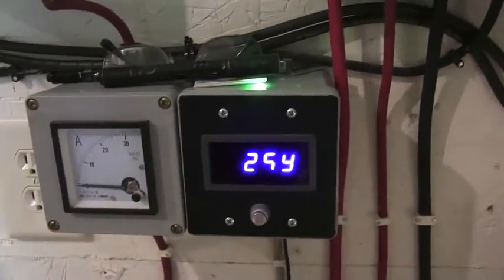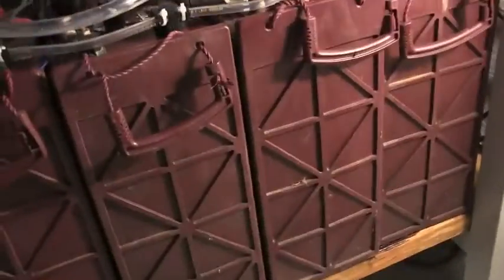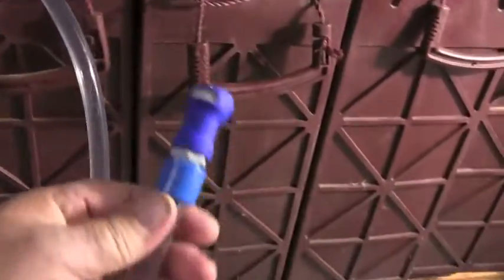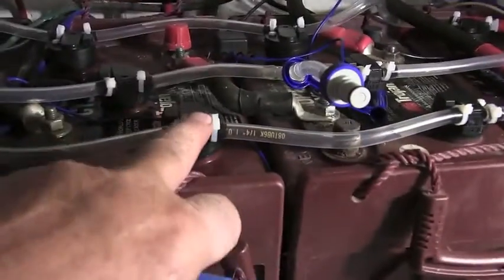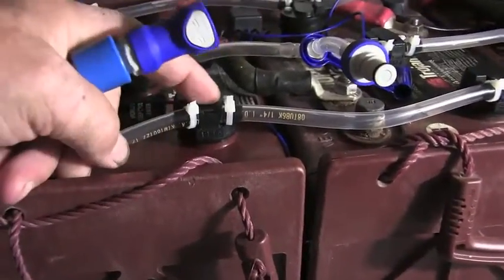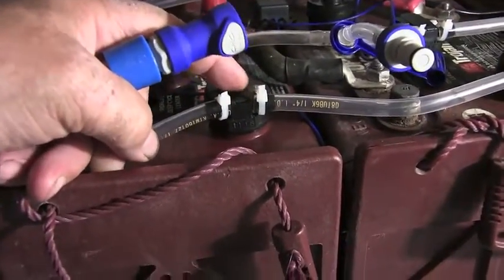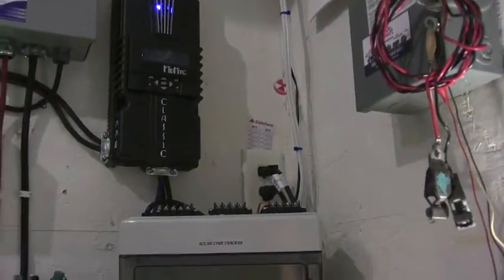When this light turns red, it will tell you that your batteries are low and they need water. So then what you do is take the end — here it goes up to that jug. It's got a little chuck knob on it, and you just plug it into this line here. They give you all the line. You remove your caps from your old batteries and slip these in. They've got a little white float, and this little white button will pop up and tell you your batteries are also full. Just plug this in — that little wheel up here turns saying it's filling up.